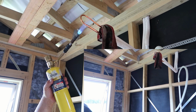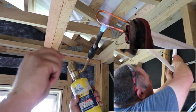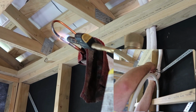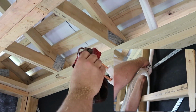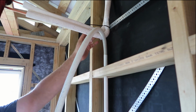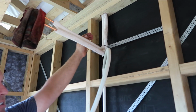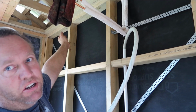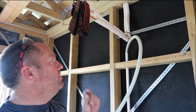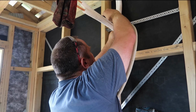Now what we do is we get these cable ties here, and see we might line up with this hole here. So we poke one through this side, and we go around, and we cable tie this on. This is so the chippies don't push it too far to one side, so we can always have our pipe centre. It's a real hassle if you have to move them up or down, which you can do a little bit of. I've had it where they've pushed it aside about 300 mils, and there's no way of being able to bring it across without having to cut holes and rejig. So by doing this, they can't.